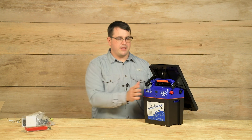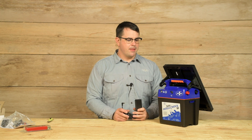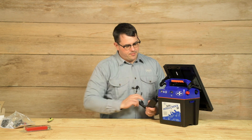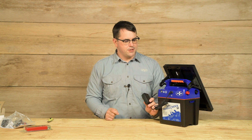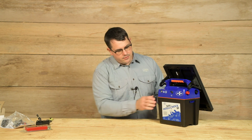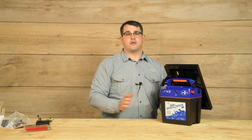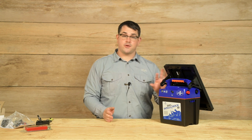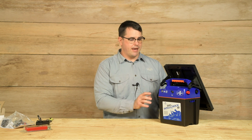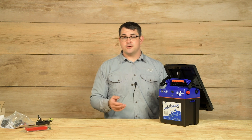As mentioned earlier, it's a good idea to plug this in for a while to top off the batteries. With the AC adapter, you can do two things: run the energizer as a plug-in unit, or recharge the battery. Since we've just unboxed this from shipping, I'm going to top off the battery — plug in the adapter, open the port, and insert the recharging device. Once you've done that for a couple hours, you can check the battery using a battery meter or multimeter. Another simple way is to hit the on-off switch: if it blinks green-green, your battery is topped off; if it blinks green-red, you need to recharge or let it sit in the sun; if it blinks red-red, you should have recharged it already — you're draining too far down on your battery, beyond 40% charge, which hurts the battery's ability to maintain a full charge.